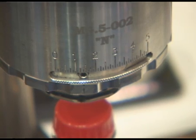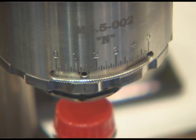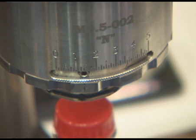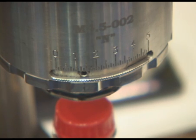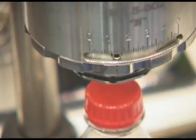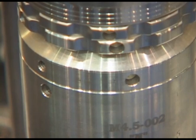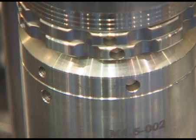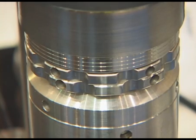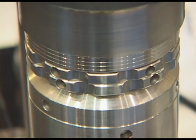There are simple setting scales for both the top load and the torque. The torque scale has a one through five setting — it's a simple matter of loosening a couple of set screws, rotating to that position, and re-tightening. For top load, a couple of jam rings are loosened, set to the proper scale number, and re-tightened. You can see the concentric rings on the top load spring covers, which give a visual indication of the head rise setting for the machine.